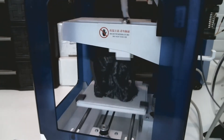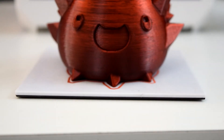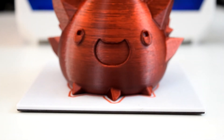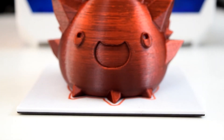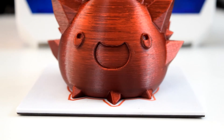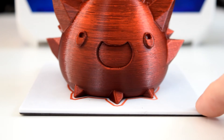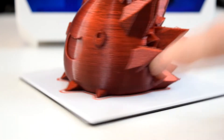The only thing that's really been an issue for me is the bed. The magnetic flexible bed is a great concept. As long as I apply a few layers of glue stick and get the nozzle height right, my prints have always done a pretty good job of sticking to the bed. However, without a heated bed, cooling PLA plastic has a tendency to warp upward while it's printing.